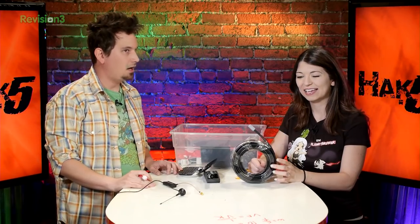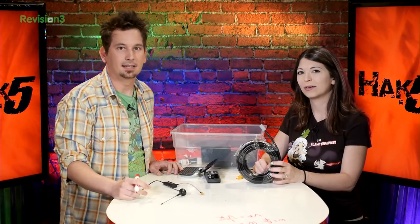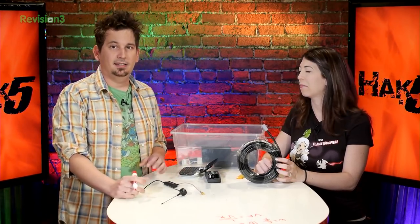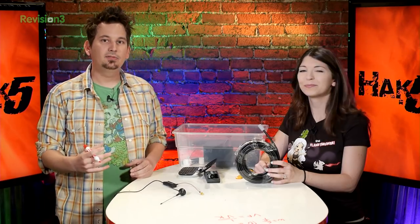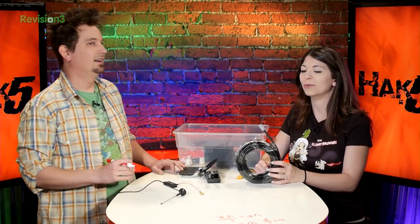So what is K? K is relative permittivity, also known as the dielectric constant. It's essentially a ratio of the amount of electric energy that a material can store relative to that stored in a vacuum of space. Right, which is why antennas are cooler in space. But we're not in space. We're here on Earth, so we have to take that into consideration.